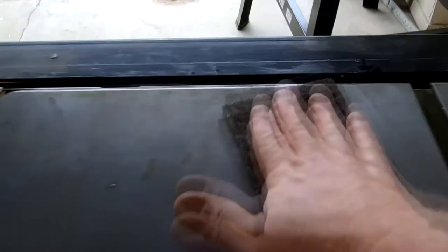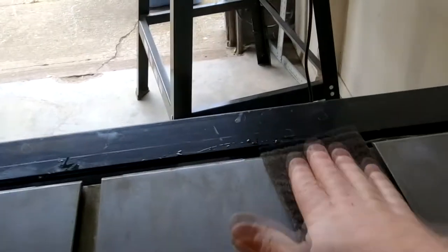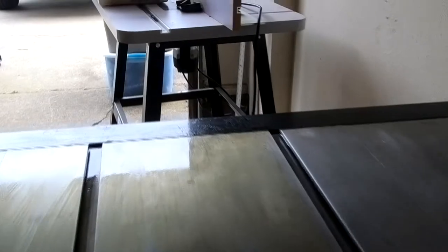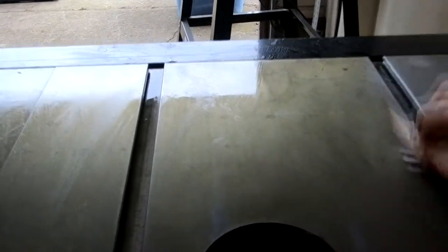I put some more lemon juice on here, wiped it off once, and now there's more lemon juice on here. As you can see, where the lemon juice dries up it begins to do what we call flash rusting — the rust is coming back. It's just an exposed iron table. When you wipe this off, make sure you wipe it off dry. You may still get a little bit of flash rust and that's okay because the next step is going to take care of that. I'm going to get as much of this up as I can, scrubbing it fresh with the lemon juice, then wipe it off quickly before it flashes again.